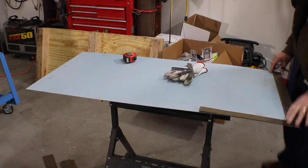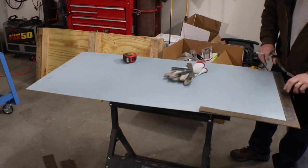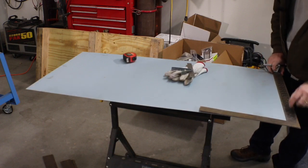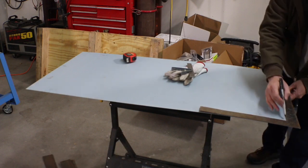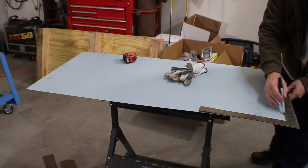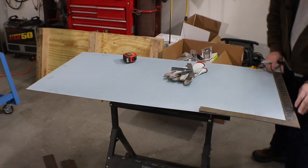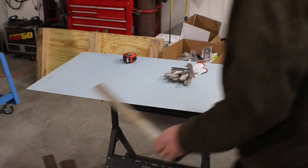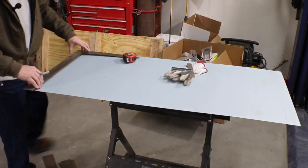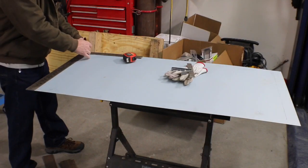For those of you with a carpenter square, this one, in fact, and most that I've ever owned at least, this arm is 2 inches wide, so you can pull your markings off of that without having to do a whole lot of measurements, just flush up the outside. That works pretty well on the end pieces here. The others we might need a little longer straight edge.